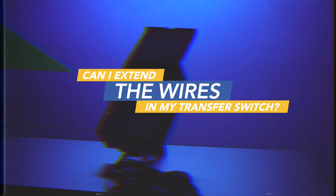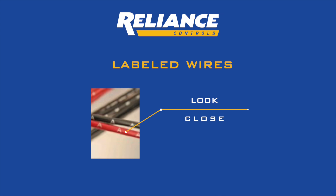Can I extend those wires if they're not long enough? The wires that we use to go in your main panel — A through J if you have a 10-circuit switch — are all labeled on the actual printing of the wires themselves. A lot of times if you just glance at the wires and you're expecting to see big wire markers, you won't see them. Look closer and down the entire printing of the wires you'll see AAA, BBBBB — that's how you know which two wires are for a circuit in your main panel. It's in silver paint, so you may want to look for that. It's silver because that works well on both the red and the black wires.